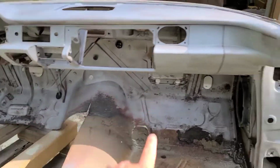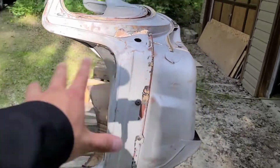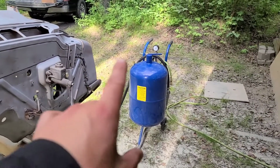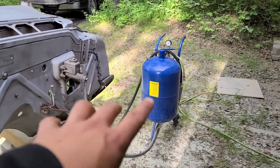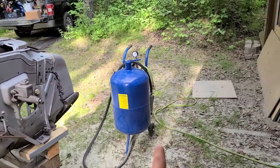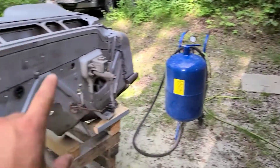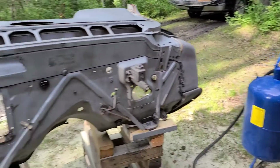This is the 3060 crushed glass. This took most of the paint off right away. So if you're getting one of these 20-gallon sandblast units, 3060 crushed glass is what you run through there. They don't have a tip that's bigger, that I've found anyway, than 3.5 for this dead man handle. So 3060 crushed glass with a 60-gallon air compressor, and this thing will take off paint and rust, not a problem. Sometimes you got to wait in between, but it does a pretty good job.